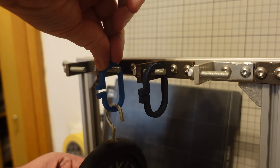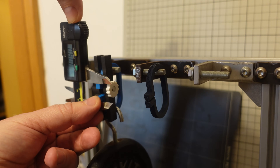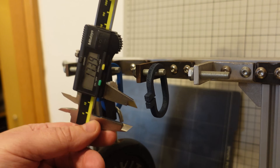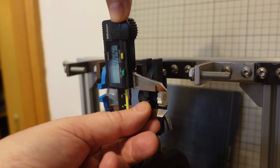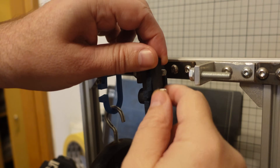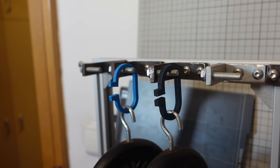The creep test — the deformation under a constant load of 1.25 kilograms. I'm measuring the distance between two reference surfaces. This is the Rigidex and definitely this deformation is very minimal, better than some ABS and ASA parts. The last fifth day of measuring.